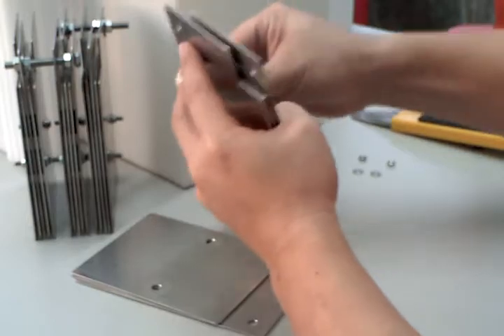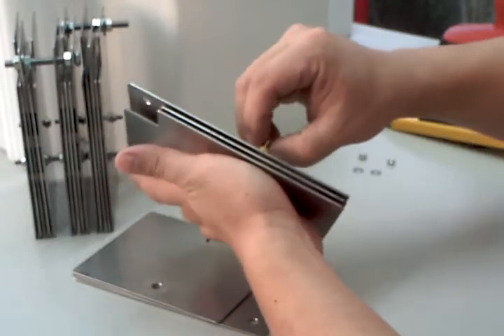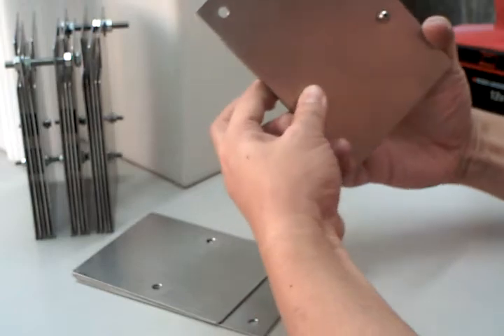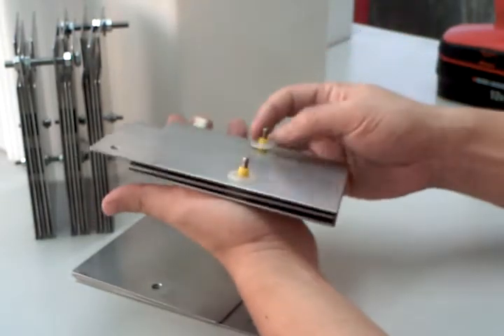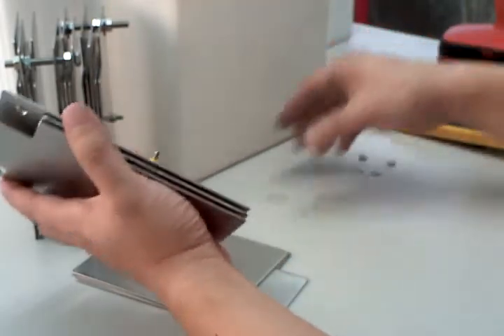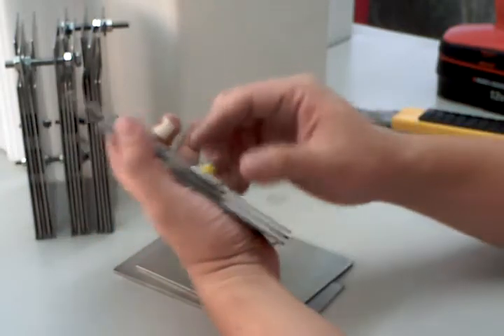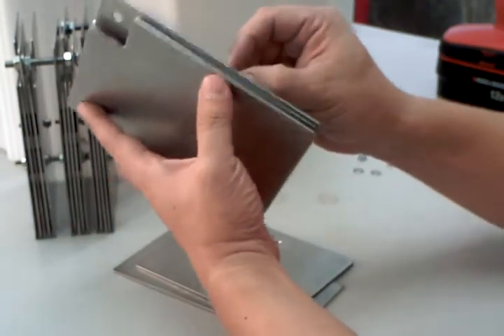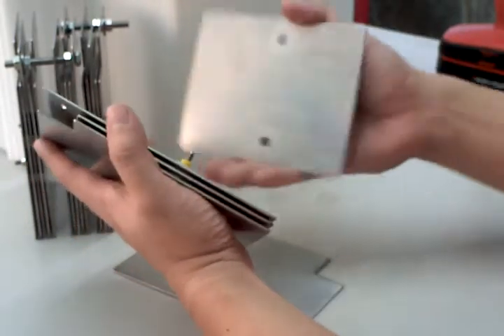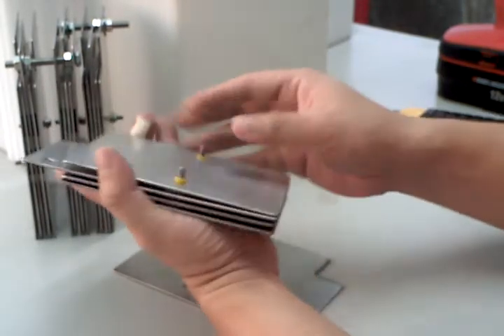Now these are silicone spacers, and I use them because I don't really trust nylon screws. During the HHO production, lots of current draws will create heat. I know for sure that silicone spacers and Teflon tubes — Teflon materials — can stand higher heat, and that's why I use them. Also for safety reasons.